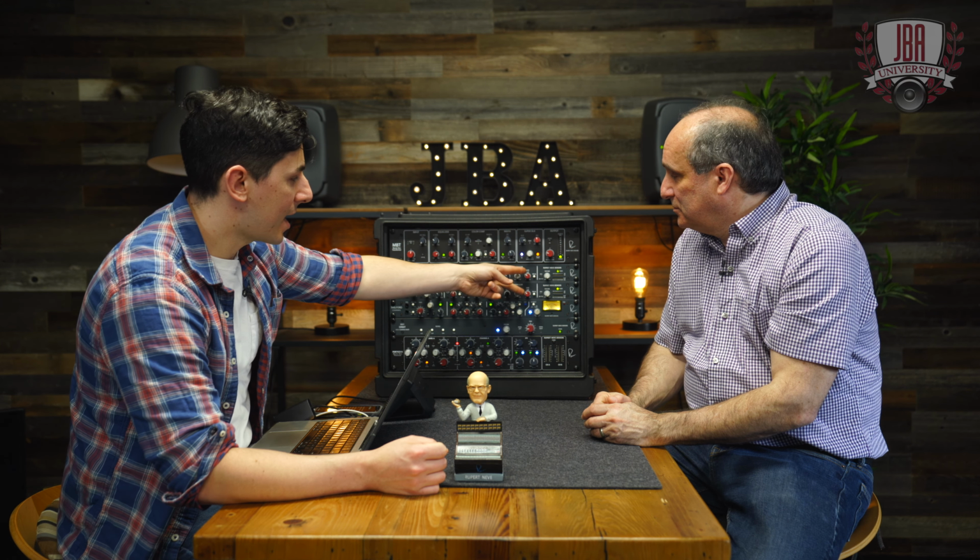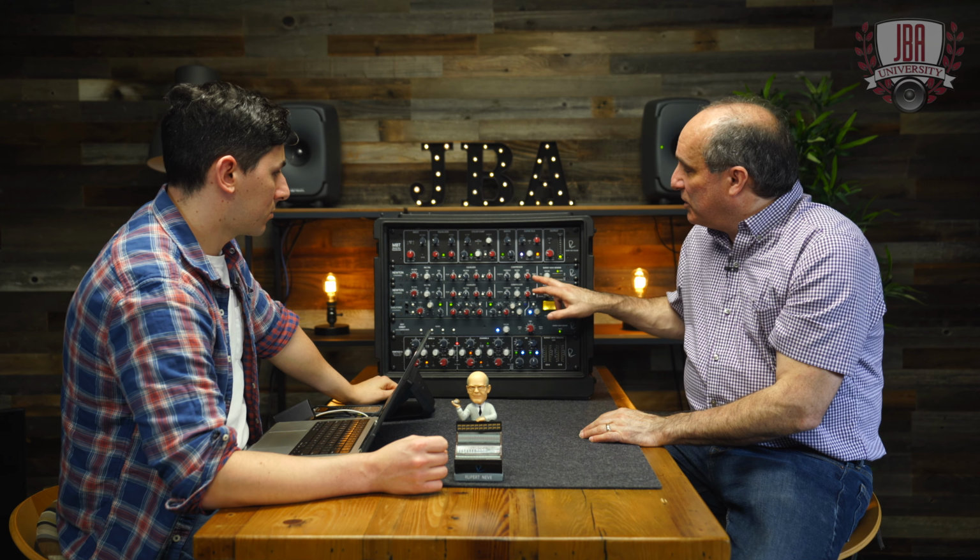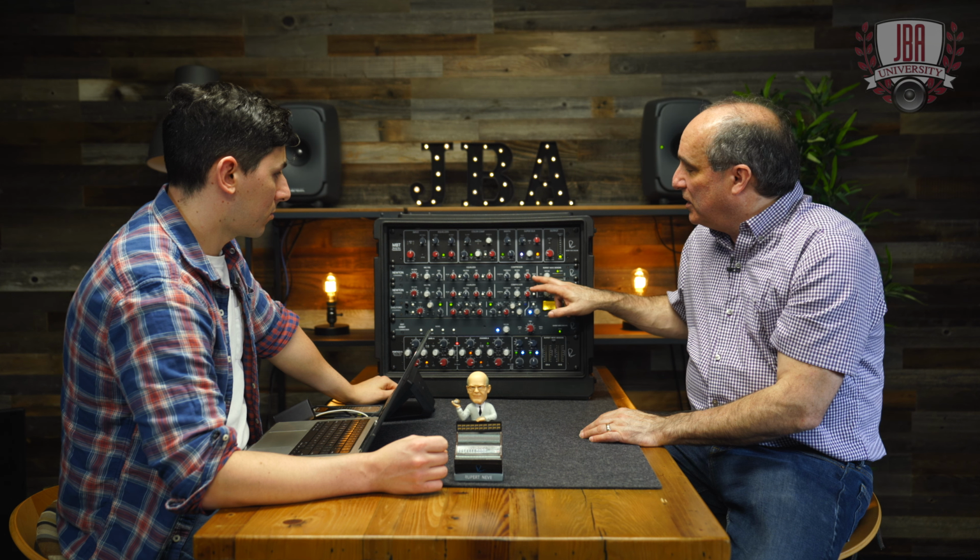the equalizer. Okay, so, talking with you already, I'm going to guess that this gain knob also functions as a drive into the next section, right? It functions as both an output level control and a drive into the silk itself. So anyway, just to finish that up, you can move the compressor before the EQ if you do more extreme things with the compressor and then want to maybe EQ the results of that. There isn't a right or wrong way to do that. It's really a personal choice and it's a creative choice.